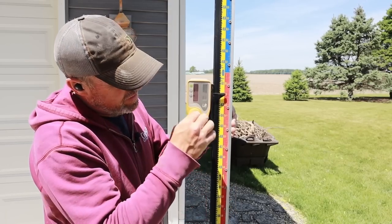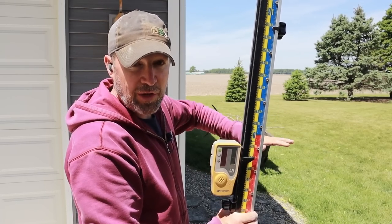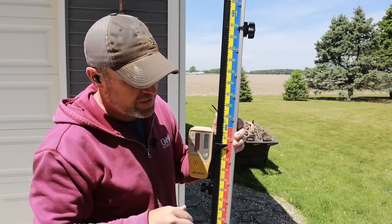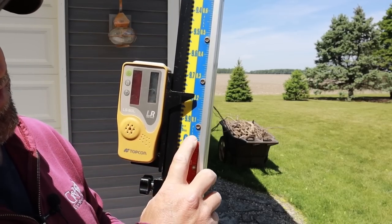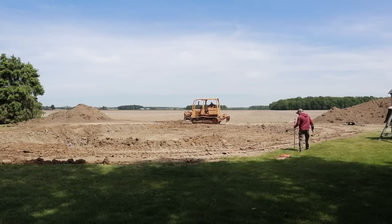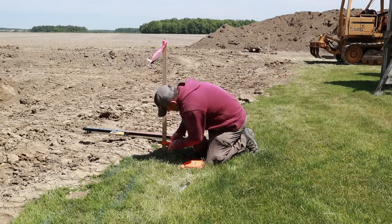If I lift the laser beam up, it'll hit the same point that makes zero-point-two the finished elevation of my concrete sidewalk around the top of the pond. At that elevation I'm likely not going to get water from the field into the pond — I don't want groundwater, field water, or flood water entering the pond. In order to be at my subgrade — with the concrete about two to three-and-a-half inches thick and some stone underneath the sidewalk — I'm going to set my subgrade at 9.8. Anything below that is fill, anything above is cut. I drove some wooden stakes or lath around and marked my subgrade elevation with orange ribbon so I can see it from the dozer.